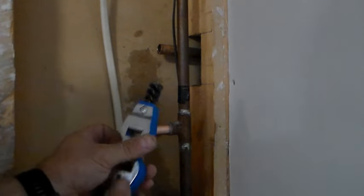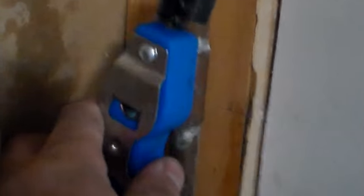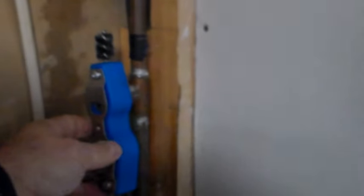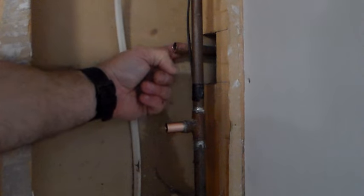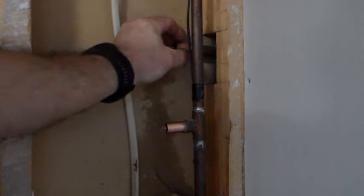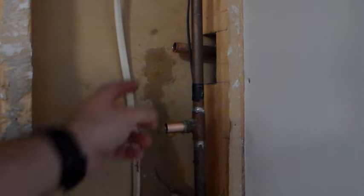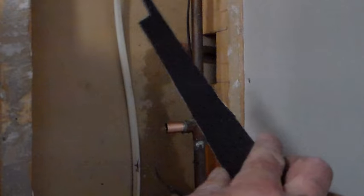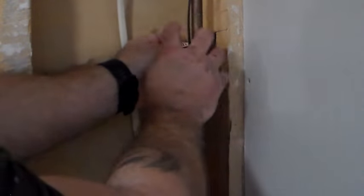Clean this up real good. I already have it cleaned up with my brush, and this brush also has a built-in deburr. The deburr tool deburs the inside as it's cleaning the outside of the copper — really nice tool to have. Now this other connection is right up against the wall; I can barely get a finger through here, so I'm not going to be able to fit the ProPress tool in here. We're going to use a SharkBite to splice into this, and then the rest will be run using expansion PEX. Just grab some 100–120 grit sandpaper and clean that up. You always want a clean surface so you don't have any leaks.